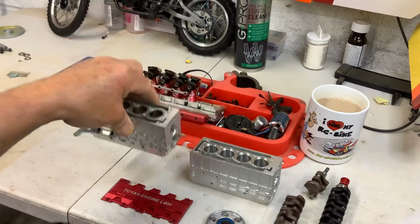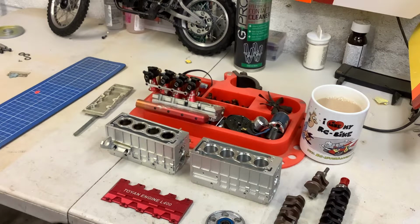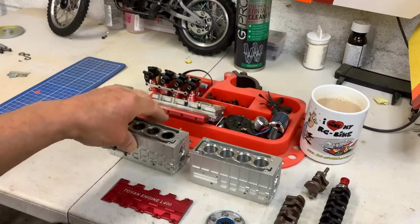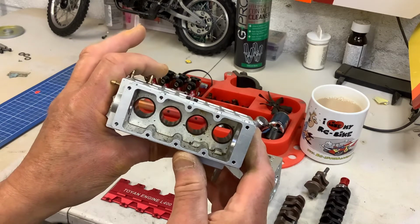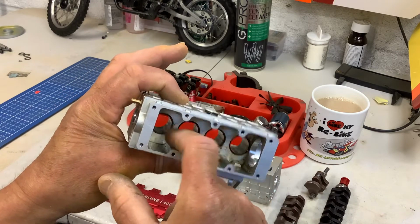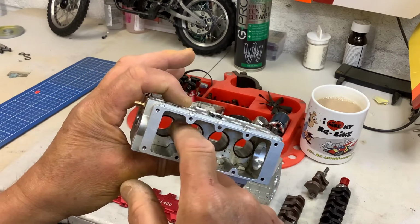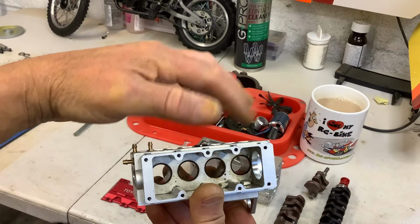So anyway, to cut a long story short, I've been waiting and waiting and I've been contacting Engine DIY. And they said that they're working on the problem, because I think it must have been everyone I've seen, even the guy with the NSU moped, I believe it broke. And everyone's saying it's calling out for a centre bearing, but Toyan seem to be going their own way and not doing that. I think you could actually put four main bearings in there. There's enough room there, and I would come in from the side there, and not just put one in, but do four.